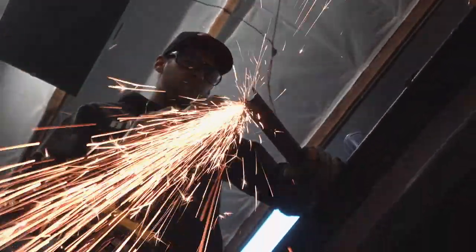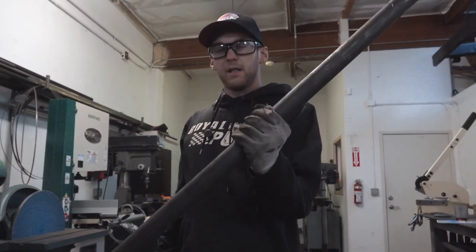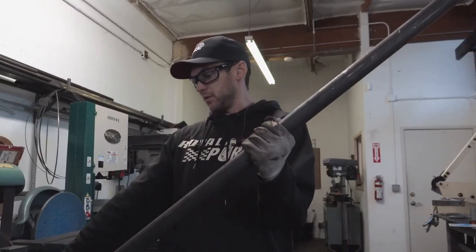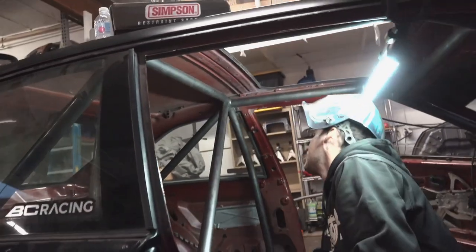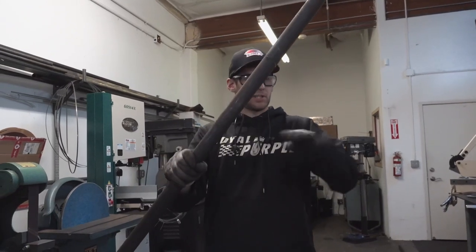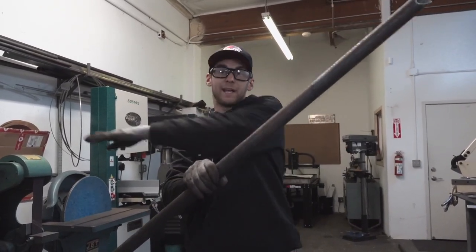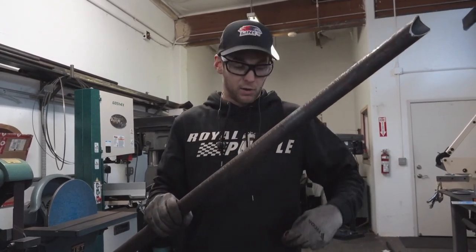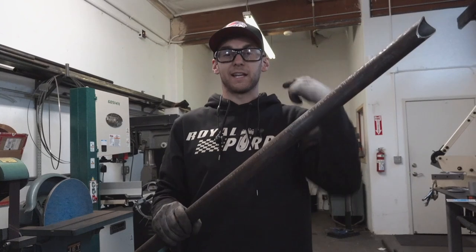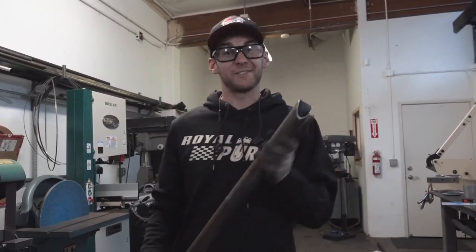This is the diagonal bar that goes in the main hoop. The whole main hoop structure that sits behind your head needs a diagonal support that goes from the passenger side to above the driver's side, so it'll sit right behind my head. Then connecting from the main hoop diagonal bar to the main hoop again is the harness bar - exactly what it sounds like, it goes over your shoulders through your seat and connects to the harness bar for front impacts. We're getting close now.